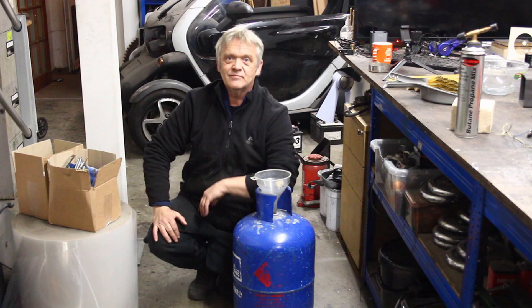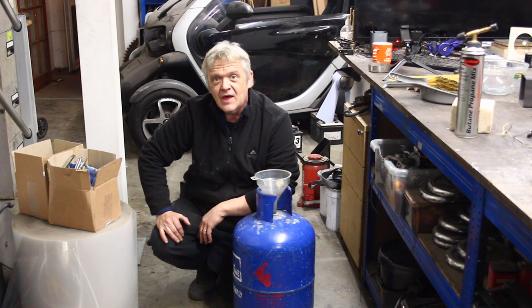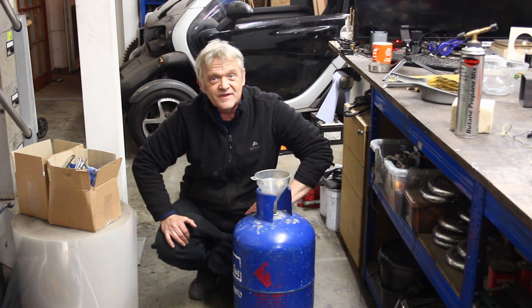Given that some time to empty out, now all we have to do is fill it with water. Filling it with water will drive out the remaining propane that's in there and make this safe to use. So let's get it filled.